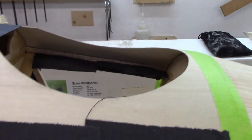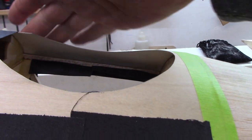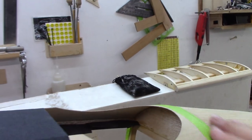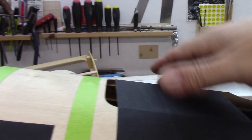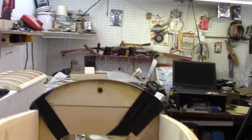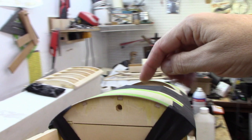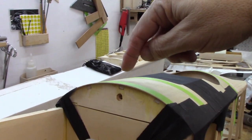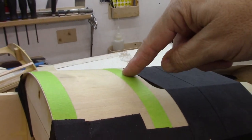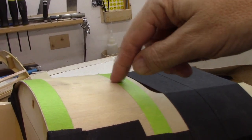Let's see how well you can see this because of the light differential. We're all good along the outside edges on the backside — it's all sitting down properly right on top, and it does have epoxy all the way across each former and across each stringer. The best thing I can do is show you up here at the front. As you can see, there are no gaps at all all the way over the top. When I lined it up with the thumbtacks I pulled out the front and the rear — this one I have not pulled out yet and it won't get lifted because I don't want it stuck in there.